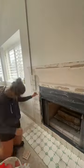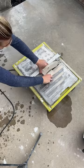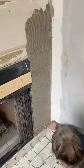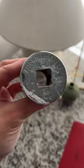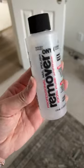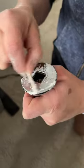I kicked things off by mixing up some mortar and then I started laying my tiles in place. After tiling my guest bathroom shower, you could say I'm pretty much a pro at this now — just kidding, I'm nowhere near pro — but this was actually so much easier than doing the bathroom. I used a lightweight board and some double-sided sticky tape to hold up my tiles in the middle so they wouldn't slip.